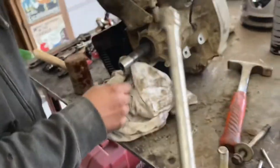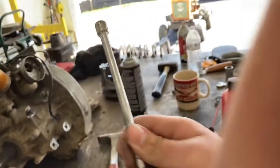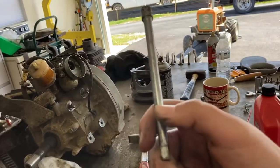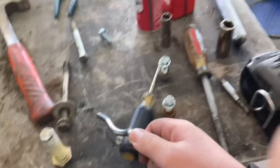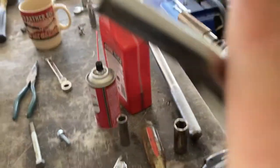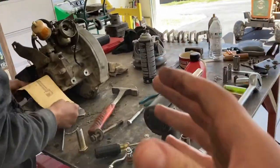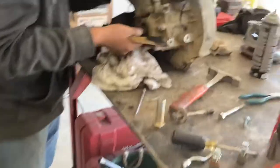Because this is what happens - look, when we put this in the shaft and started hammering on it, the quarter-inch extension looked completely fine before. And this is the aftermath of that exact one we put in there. We did not think it was going to have that much pressure, so we recommend using a three-eighths one because it's thicker and will work better.